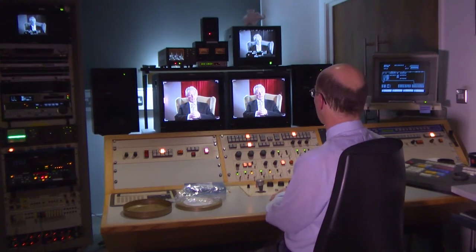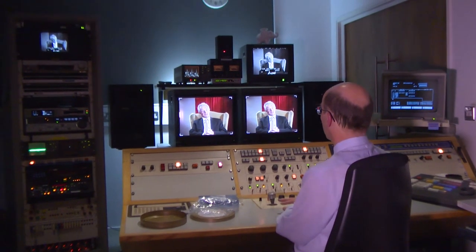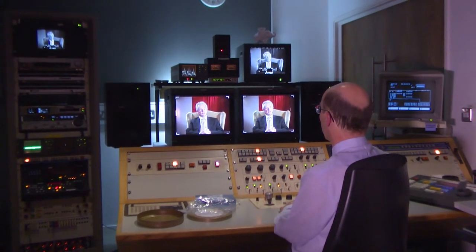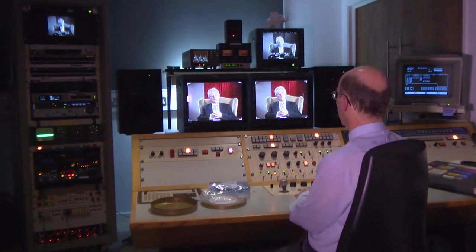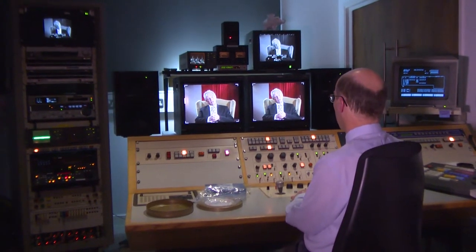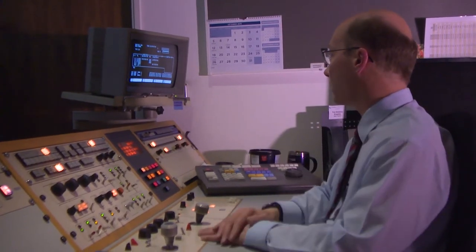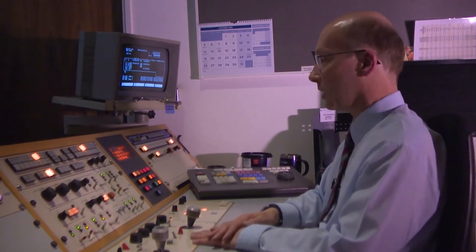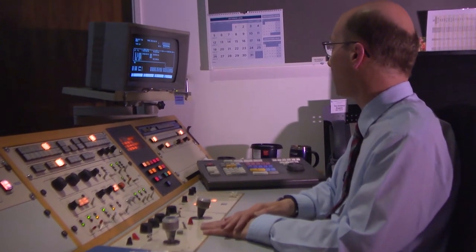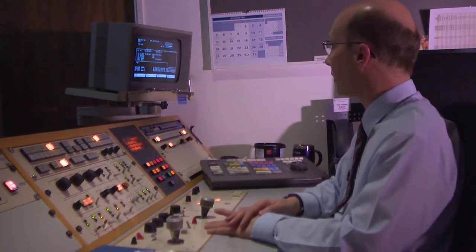The black and white monitor on top is the character display from the video recorder. Above the left hand monitor is a waveform scope, which is showing me the red, the green and the blue components as they come out of the telecine. So that is a guide to me for the grading process, and it helps me to ensure that the colours are neutral and natural, and I'm not clipping any low lights or highlights. To my right is the character display from the edit controller, where I can see the cues I've put in for the edit points, the progress of the operation, and whether I'm in assemble edit or insert, and video and audio and so forth.